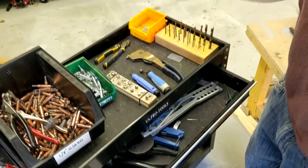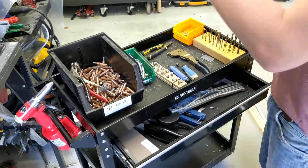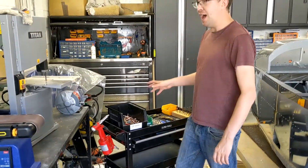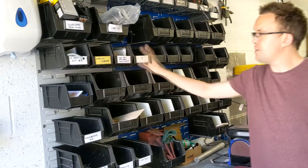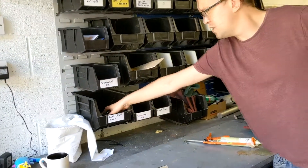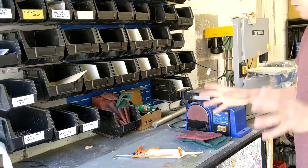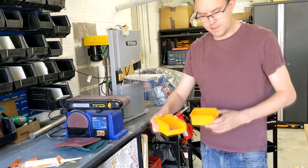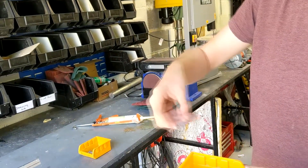Another very important bit of kit is a marker pen, because when you're cutting panels up you're going to want to mark everything — the part number from the manual — so you can relate back to it. When you break a big part number into multiple sections it's important to write down what they are, as Michaela learned when she cut up a load of bits and didn't label them. On top of that, get yourself some decent storage — I just got some Lindy bins stuck on the wall. Label up the bits you're not quite going to use yet, leave them out of the way, and you can get to them when needed. You also get about twelve to fifteen thousand rivets in a big box. Don't leave the big box on the wing or wherever you're working — if you knock it on the floor they're everywhere. Use a small tub and count them in and out. One of the first things you make in the build is a little angular rivet tool so you can put rivets against edges and still press the head down nicely and get your rivet gun in there.